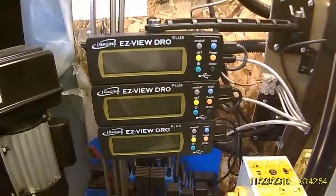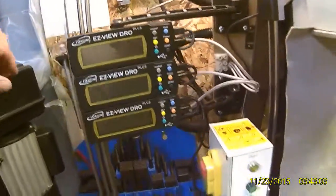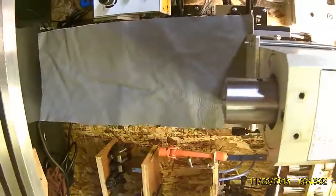I got the triple DRO set up. That's pretty much the whole reason I took the mill apart — I was going to put the DRO on it and I wanted to have it on the table. I had to take it apart to drill and tap various pieces. There's nothing special about how I mounted the DRO, but I'll show you the z-axis. I had to drill three holes: two in the z-axis and one in what I call my carriage. I've got just over 12 inches of travel on my z.